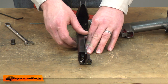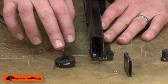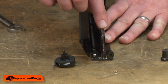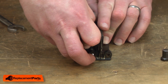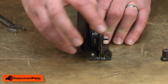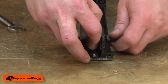Now I'll open up the magazine guard and I can pull the feeder away from the feeder shoe. Now I can install the new feeder. First, I'll place the feeder shoe back on the magazine track. Now I'll install the feeder through the shoe and the magazine. The cable should be up, and I'll secure all this with the lever.